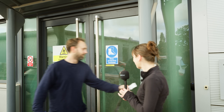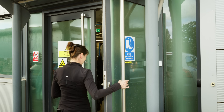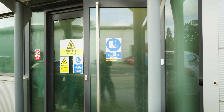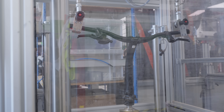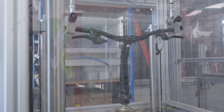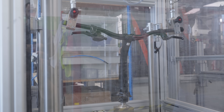Test rig number one: this is a handlebar test rig. It's testing in accordance with ISO standards, which requires 100,000 cycles of left and right, up and down. Interestingly, this is the mountain bike standard, not a city bike standard — so it's really brutal — and it needs to not break.